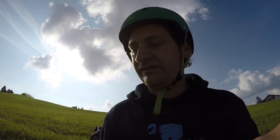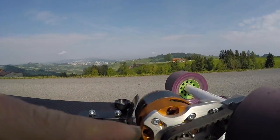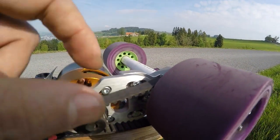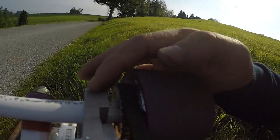You can build motor mounts yourself if you're skilled enough, but if you're a normal hobbyist like me, you really should buy one. The screw-on mounts are better because you can put them on different trucks. It's also very important that the mount is adjustable so you can adjust the tension of your belt — this belt is a little bit loose actually. You really want a good solid thick aluminium mount.